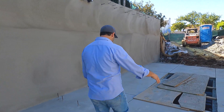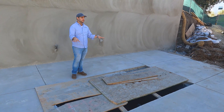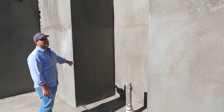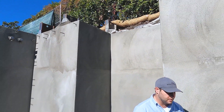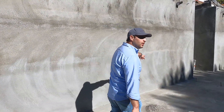We'll have a few walls — there'll be a home theater in here, an elevator, and a mud room. That right there is the garage. Inside the garage we've placed our sump pumps, so we'll have a steel frame that goes in there so the cars can still drive down and park safely. We'll have two bathrooms in this basement. And those forms right here — they're called light wells. They're for egress: in case of emergencies, when someone's down here and needs to get out quickly, they'd get out here via a ladder and get up and out safely. Those are installed in bedrooms or livable areas, so we'll have one in the main area and one in the bedroom right here.